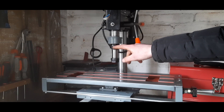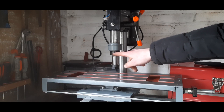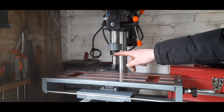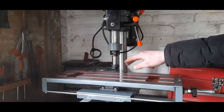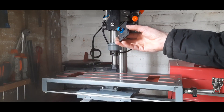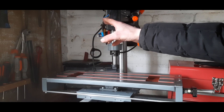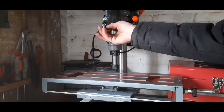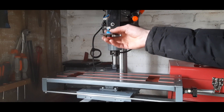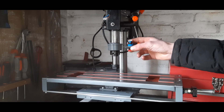The setup of the taper is actually not that good — you can see there's a gap in between this. I can very easily fix that problem, but currently I don't have access to a lathe. So these wires are where the e-stop used to live — I just shorted them for now, because earlier today I was doing a small test of the spindle and I might have shocked myself a little bit. And no, I didn't catch it on video.